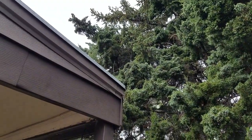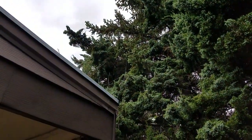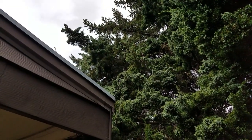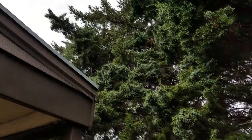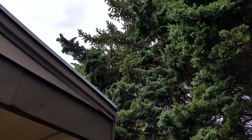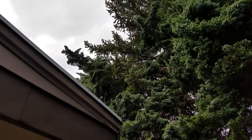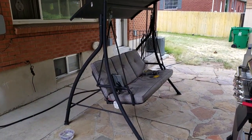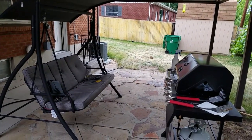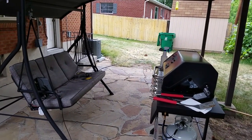This is almost a free antenna — just a chunk of coax and some wire spooled off a reel. I used 18-gauge copper stranded wire, cheap Chinese wire, and a little bit of fishing line. I hope you enjoyed this video — thanks for watching. I'll keep you posted on the station setup because I'm going to throw up my tower and beam and get my full station back up, but currently I'm just running QRP on the patio barbecuing. That hickory smells so good. Over and out.